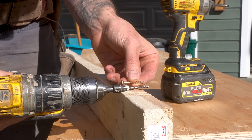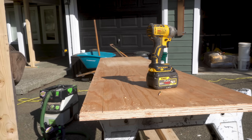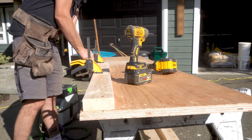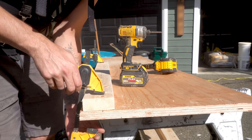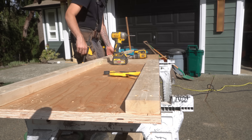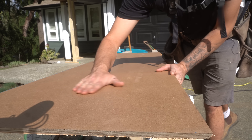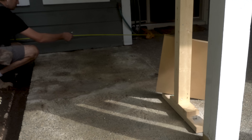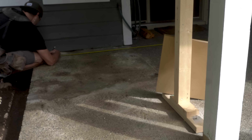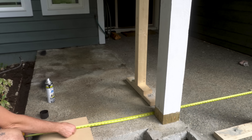Because I didn't want any holes on the inside of the form I attached my bracing from the outside. Using 2x4s for bracing, I set my countersink up to 2 inches deep and drilled a series of holes, then attached the 2x4s to the outside of the plywood using 2 inch screws through those holes — top and bottom, staggering the 2x4s to the plywood. I then flipped it over to check I hadn't screwed any screws too deep. I made a mark 6 inches away from the existing slab and measured from the house to that mark, then transferred that measurement down the run so the concrete form sits parallel to the house.